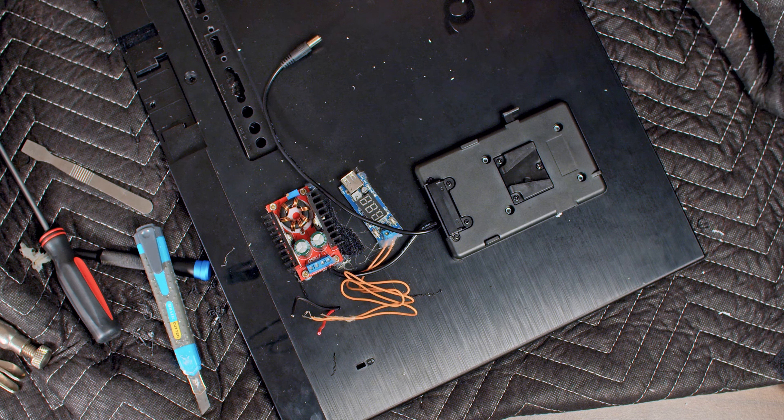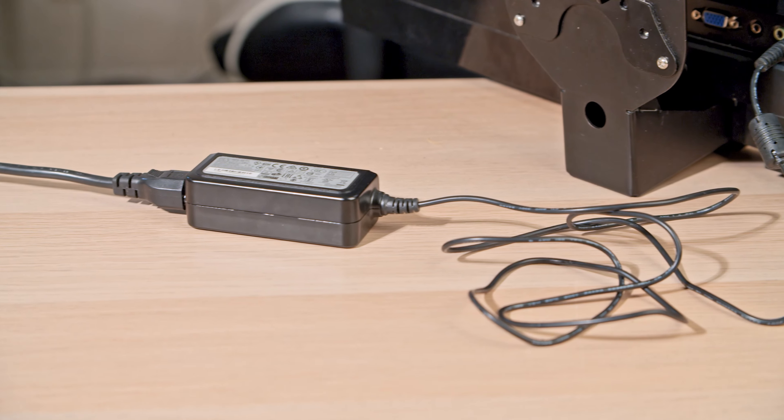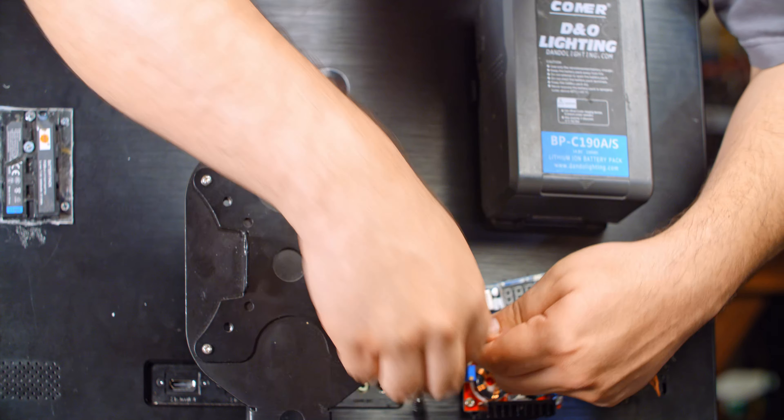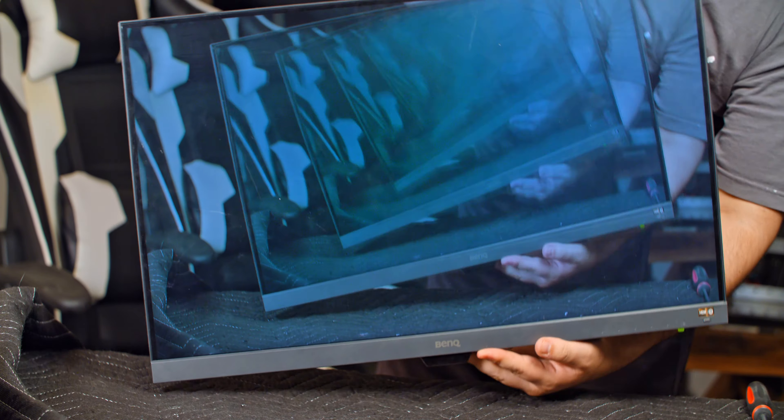The next step is to add the cable to the output side of the DC converter. If you're using this monitor solely for this purpose, you can just cut the cable from the included power brick and guarantee compatibility. Otherwise, research the barrel size of the connector of your monitor and get a matching one to use with the converter. Now whenever I'm at the desk I plug in the brick, and while I'm on the go I plug in the battery-connected barrel — and it's now battery powered.